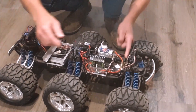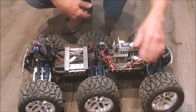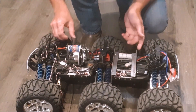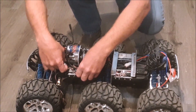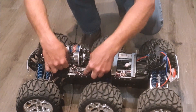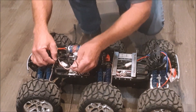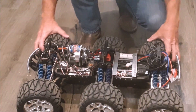Next was the steering. The front steering went to two servo control, and then obviously I had to do the same in the back, giving me basically a four servo steering arrangement. Each pair of servos — front and rear — is connected to a servo cable splitter. Then the front and rear servo splitter cables are fed into an adjustable servo mixer cable. This way, the single steering signal from the radio or microcontroller is fed into the mixer cable, where I was then able to invert the signal to the rear servos and fine-tune the ratio between the front and rear steering signal so that they would be in alignment at neutral and steer together in coordination with one another.